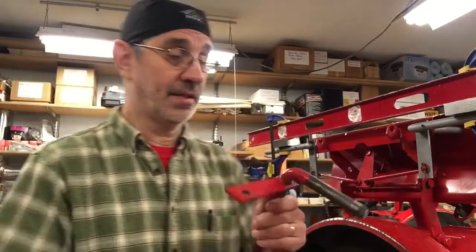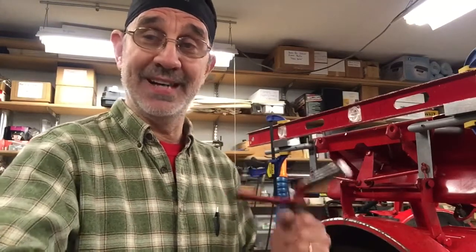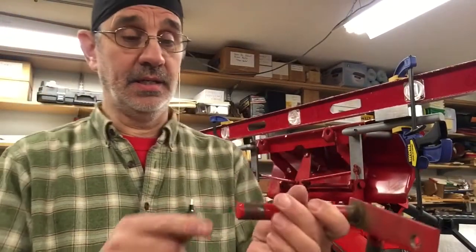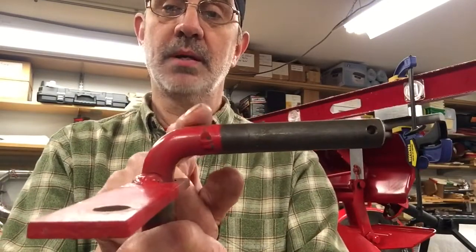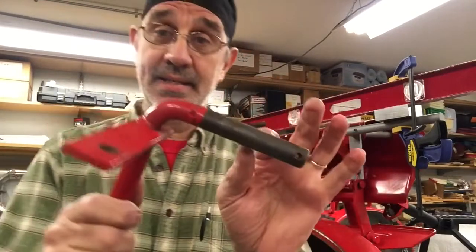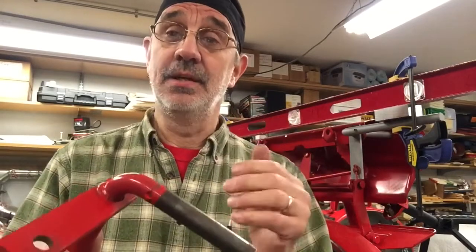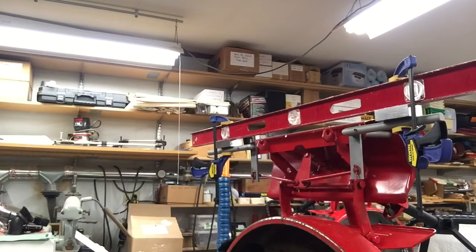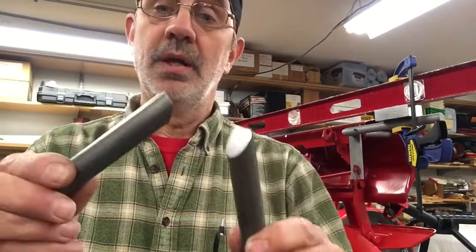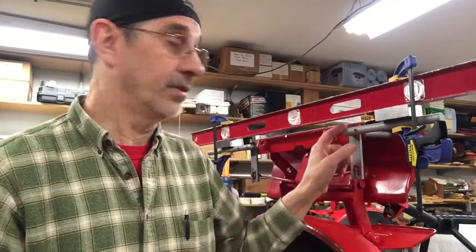So I can't pinch this to get it straight across. They have machines and dies that do all this. I cannot get the snap ring groove where it belongs, and this pinch mark and this hole, and then bend this bar. It's never going to bend where I want it to because I don't have the dies to do it with. So how I did it, I'm going to make them with a corner. I 45'd them on a mill, put them together, and welded the corners.